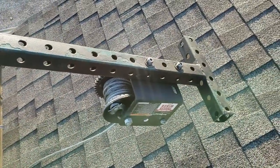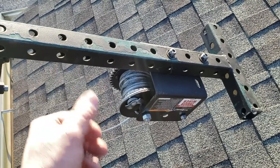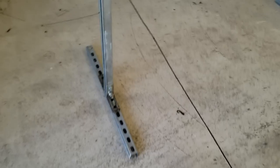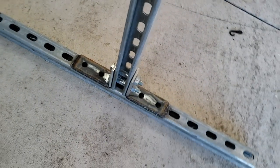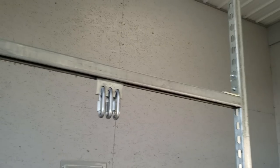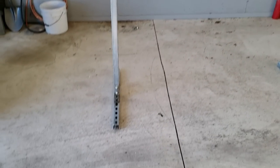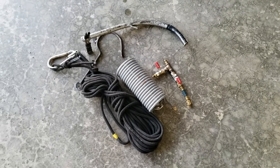You could actually move the winch back and put a pulley there — that would double your pulling power. The last little invention here is another small crane made out of unistrut and basic L brackets, welded on to the metal below, with a hole drilled sideways and a half inch bolt so you can change the feet, adjust the length and height. It's basically a little trolley system — you put a chain come-along on it, put your compressor below, and lift it up.